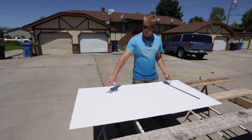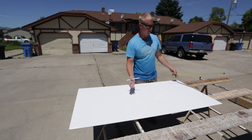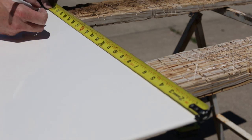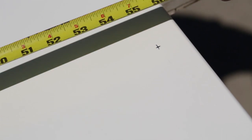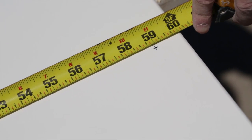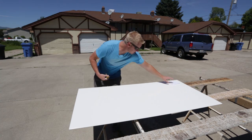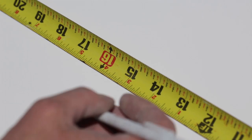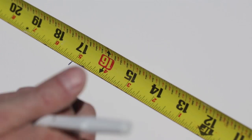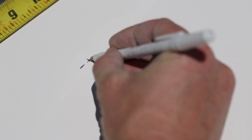I've laid this out and pulled it out of the box. You want to put the finished edge down and lay it how it sits in the house. From the finished edge we know we were at 17 and 7/16 inches to the center of the upper spigot, and from the top of the tub — which is the bottom of this piece of marble — at 58 and 15/16 inches. Draw a little line. Then come down to the lower spigot: 17 inches in from the finished edge, 8 and 5/8 inches from the bottom. The lower one was at 17 inches and 2 and 3/4 inches. Draw a little line.